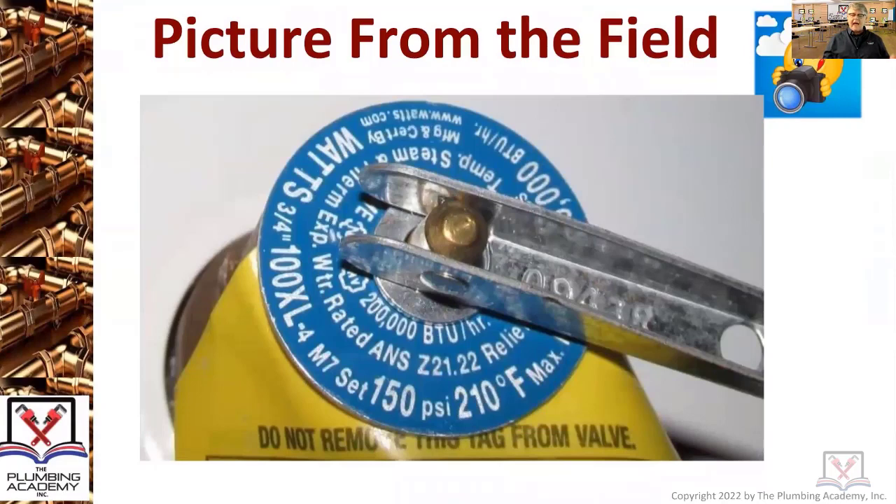The thing that makes you look like an absolute fool is when you screw a piece of PVC into the outlet discharge of a temperature and pressure relief valve. Schedule 40 PVC breaks down at 180 degrees, and you're going to screw it into a relief valve that doesn't even discharge until 210 — it's going to melt and start spraying water in all directions. Sometimes there are little kids playing in a playroom because the water heater is in a closet with louvers on it. I could tell you hundreds of stories about really negligent plumbers who paid zero attention to what they learned in school and maimed little kids for their entire life.